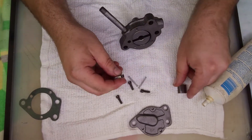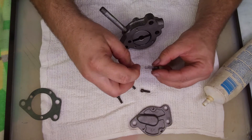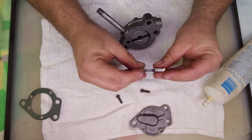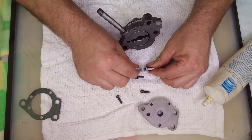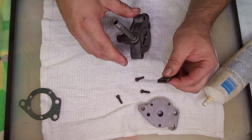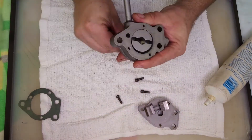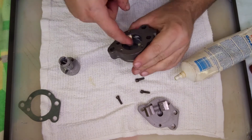Now we need to install the blades. Notice there is a 45-degree angle on the corner, so it matters which way is which. I can tell from the wear pattern — this side is going to be up. But if needed, the shop manual will tell you also. This edge with the 45-degree bevel faces the direction of rotation. I should put a tad more grease on the side than I originally did before installing.